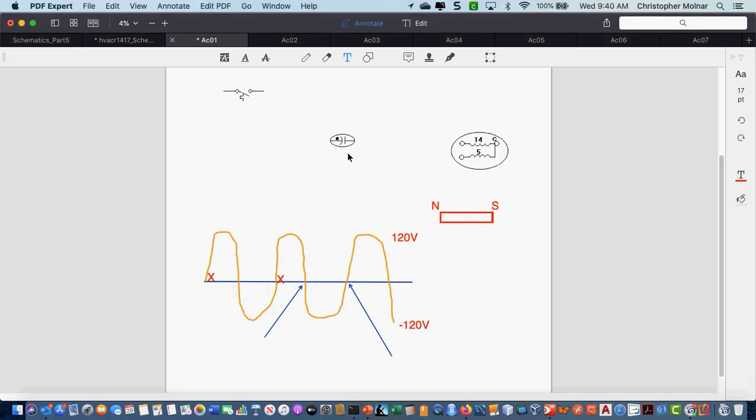So our purpose of putting a capacitor in is that the capacitor, as it charges and releases, is about 70 to 90 degrees out of phase with my main power supply. Again, my drawing's really bad. It's a much smoother sine wave. But one of these windings is connected to the capacitor, and it releases the current about 70 to 90 degrees out of phase with the main current.